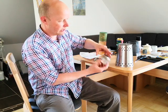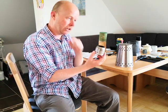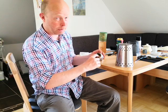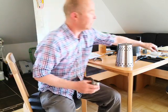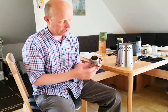Here's the stove. Stove's made from an old aluminium beer bottle. Inside it is a Red Bull can. So there's holes on the outside, and then you can't really see it very well. There's holes on the inside, so it's a double wall, chimney type stove. You find with a beer bottle, when you cut the neck off, it's a bit big. And the whole way to get these working is you need the right balance between the outflow and the intake.